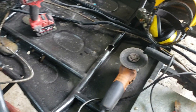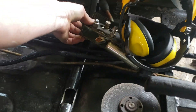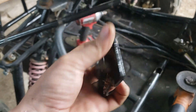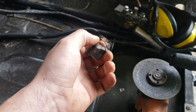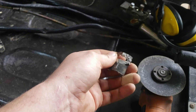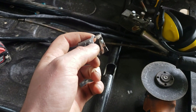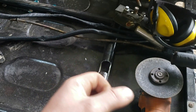Just showing you guys what I've done so far. I've cut the bracket out where the gear lever was mounted, which is over here — this was the bracket. I've just got to clean it up with a flap disc so I can remount it further along the rail. I had to cut out a little notch because when I cut the lever out it had a big enough hole, so I just cut this little bit out. I'll measure this up on the pipe — basically I'm just going to get another piece of pipe, mark this out, put it in, weld it in, and call it a day with that.